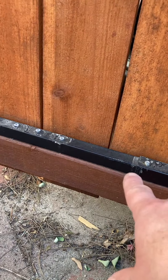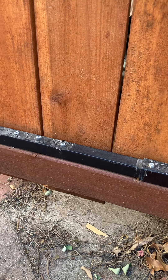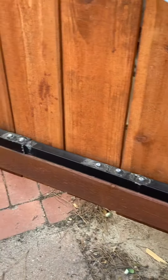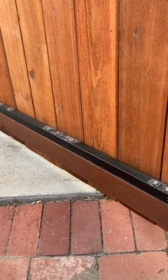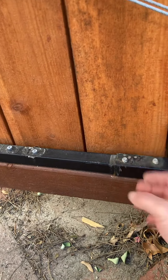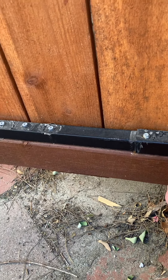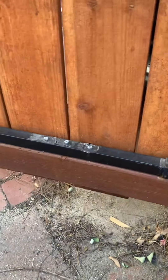You will have to go to Home Depot and buy more steel — it will fit into the curved pieces they have designed. I recommend using metal screws. I also recommend siliconing or sealing all of the holes. Make sure you're doing the holes on the opposite side from the wood, so your wood isn't up against the screws and your holes are sealed.